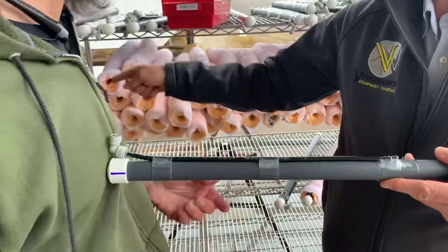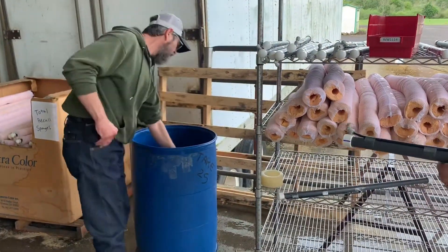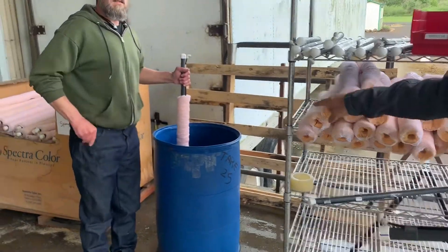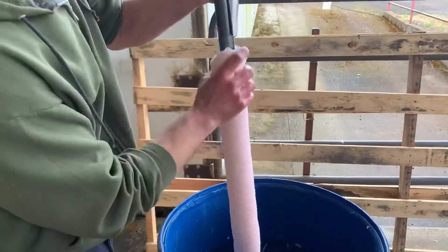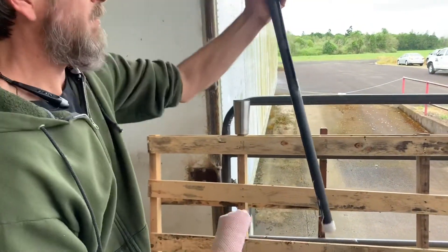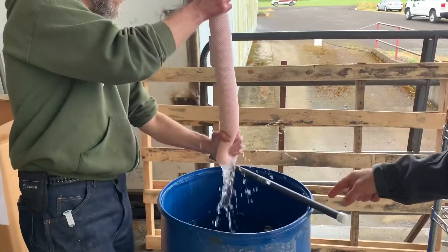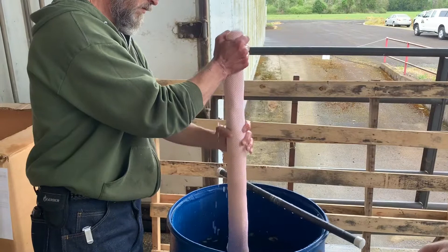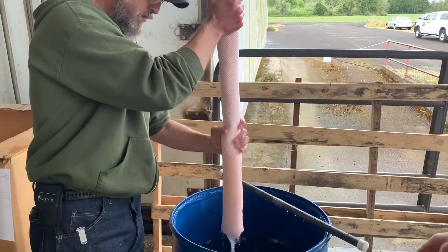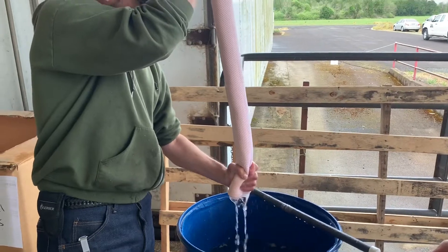Let's pull a sponge off of a new weed wiper. To start with, you're going to have a sponge just like this — get it wet and pull it off away from the elbow fitting. Key thing here on your sponge is you want to wring it out. It's got to be obviously wet to get it back onto the feed tube, but go ahead and wring it out after it's been wet, then set it aside.